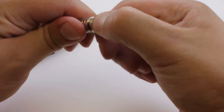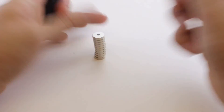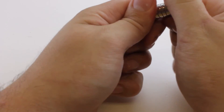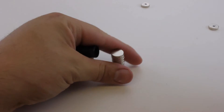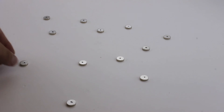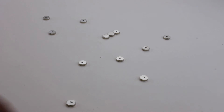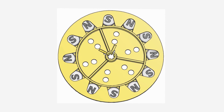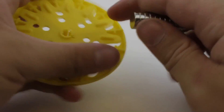We recommend that you mark the same pole and side of each magnet as you take them apart. This will help when putting them into the rotor because you have to alternate each magnet. Keep the magnets on the same side so they won't attract — it's only when you flip them over that they start to combine together. Make sure that you alternate the magnets so that each magnet has the opposite polarity of the one before it. Then just grab a magnet and snap it in.